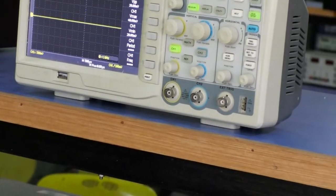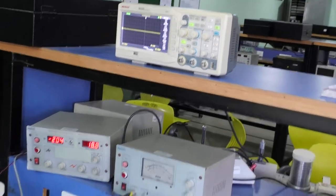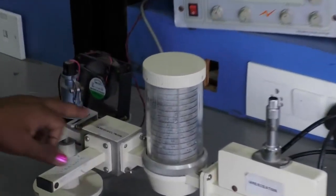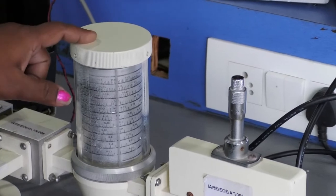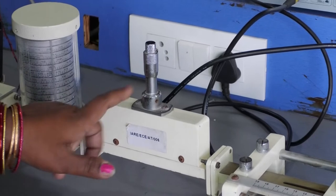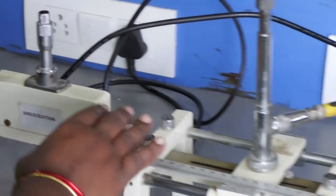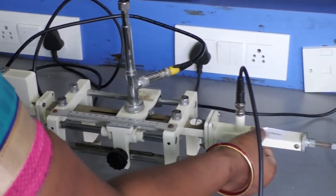The Reflex Klystron Characteristics are observed in three different modes of operation. The microwave bench setup consists of different components: Klystron Power Supply, Klystron Mount, isolator, and then the signal is given to the frequency meter — which measures the frequency of the incoming signal. After that, the input is given to the variable attenuator. By varying the position of the attenuator, we can attenuate the input signal levels. Then the signal goes to the slotted line section, which is connected to the detector mount.